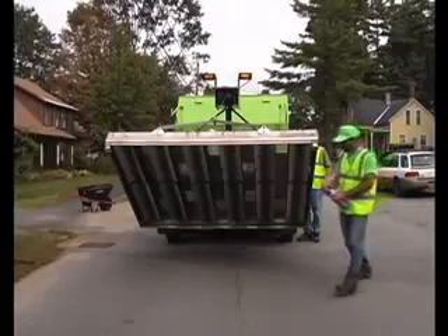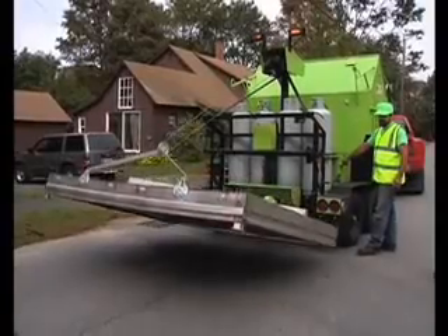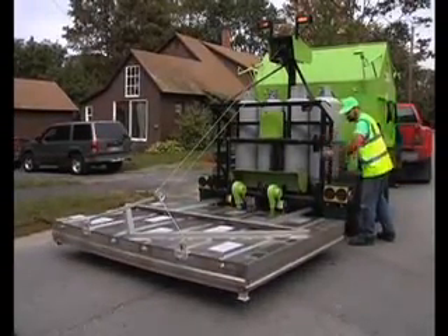The blowers and gas flow are started and the heating units are lit. When the operating temperature is reached, in approximately one minute, the 8-foot by 6-foot heating chamber is lowered and paralleled to approximately 4 to 5 inches above the road surface.